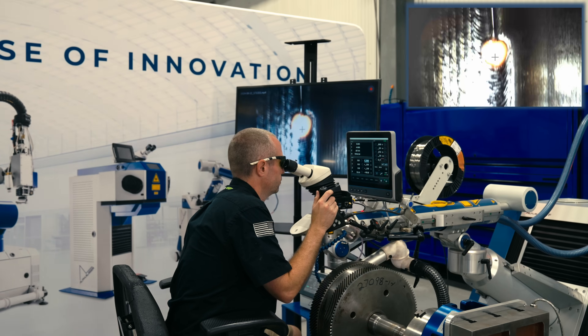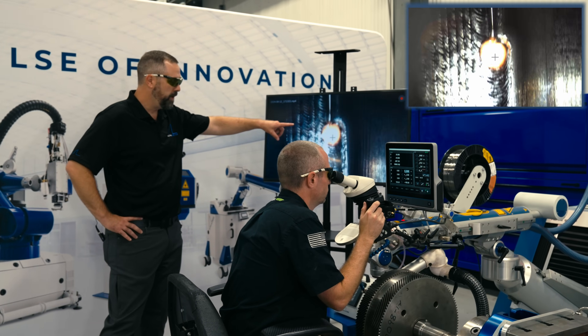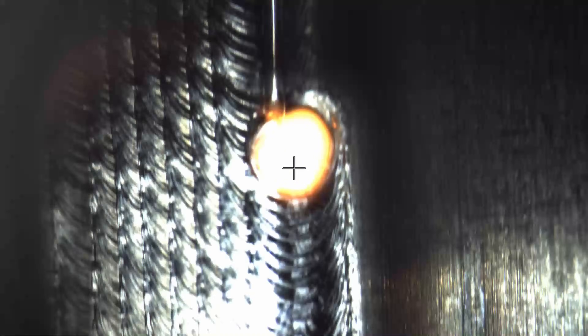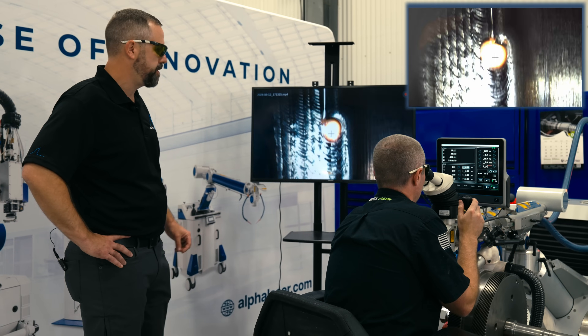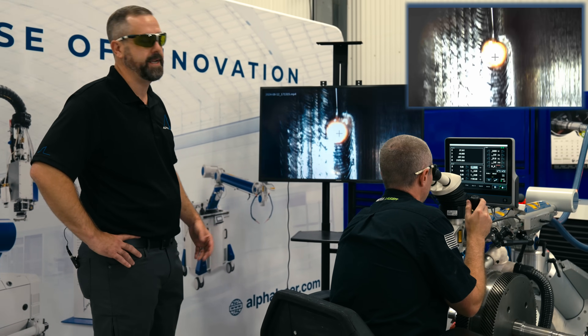You can tell from watching the video he has a good pulse with good gas coverage — it has a shiny weld. If it was black or sooty, you would know you don't have good shielding gas coverage. It's critical you pay attention to what's on the screen; if something's wrong, you can stop the machine from operating and correct the issue.